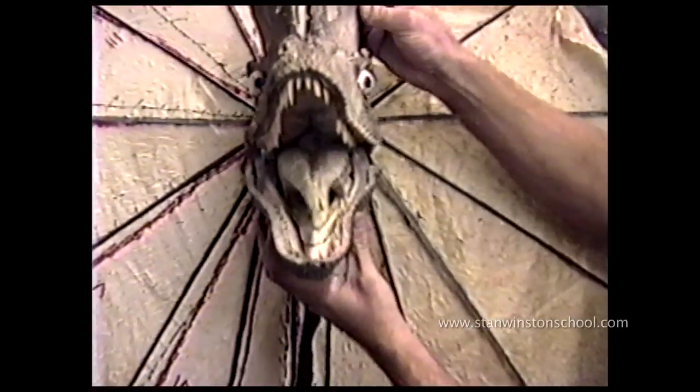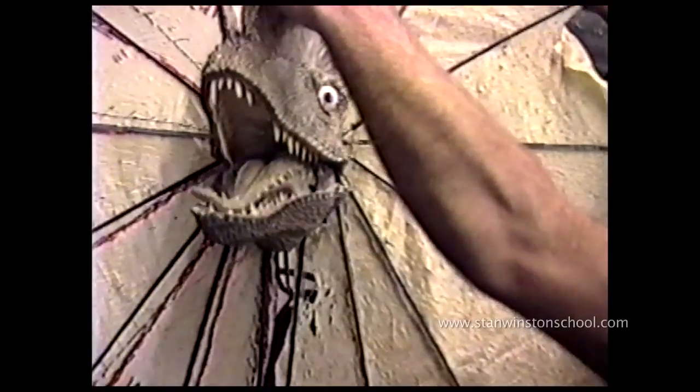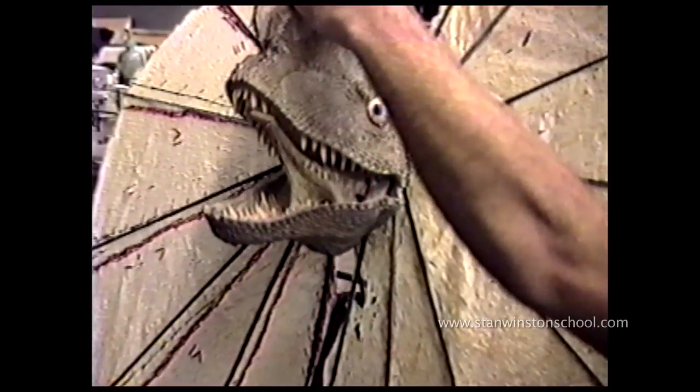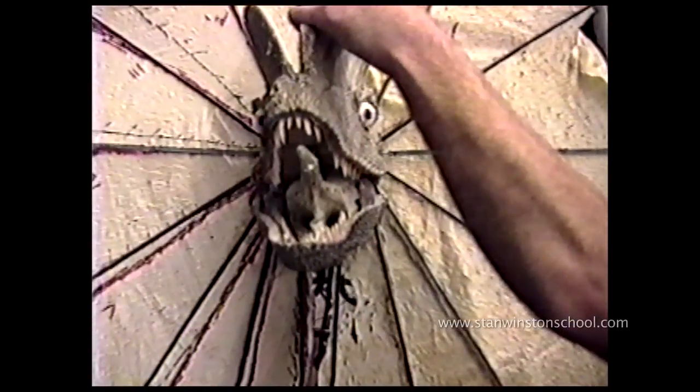Here's the tongue mechanism. This is one of the coolest tongues I've ever done. It's a two-stage tentacle mechanism, and the third section was the base of it, which would also rotate up and down. So the tongue would go left and right, up and down in each section. And then underneath are those two giant holes, which led to tubing running down through the neck of the creature — that's where we pump the high-pressure air which would spit out of its mouth.